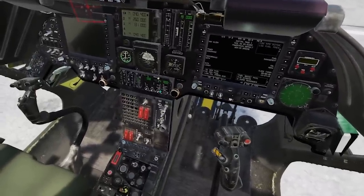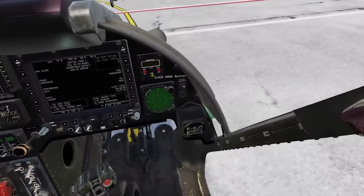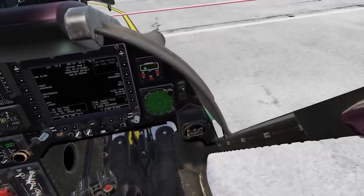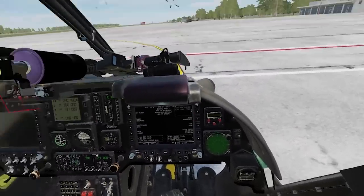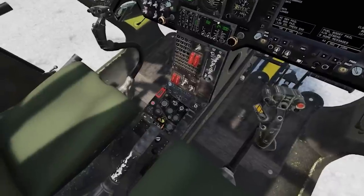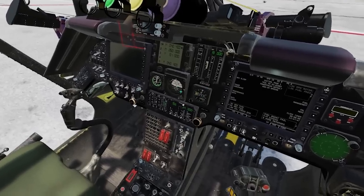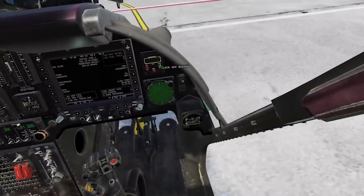I note I have 24 volts, which is above the minimum 20 required for the start. I'm going to check my clock — we'll change the contrast on this so it's a bit easier to see. I'll put my mode on stopwatch so I have zeros, and when I'm ready to start I'll hit the start timer. At five seconds I'll hit the start switch. To prepare for the start I'm going to set my throttle at idle — that tells FADEC I'm going to initiate a start sequence. I now have one minute to hit that start switch; otherwise FADEC times it out as a safety precaution.